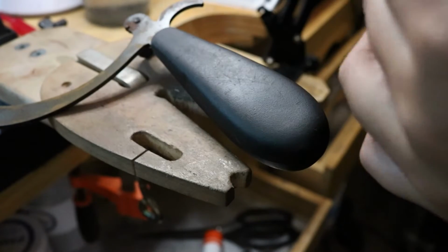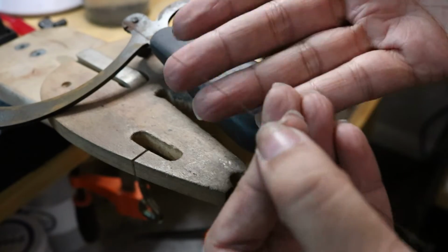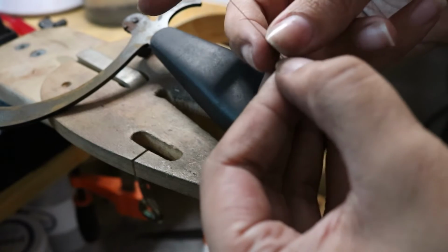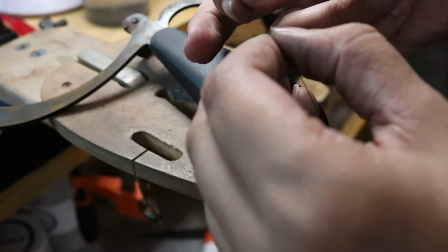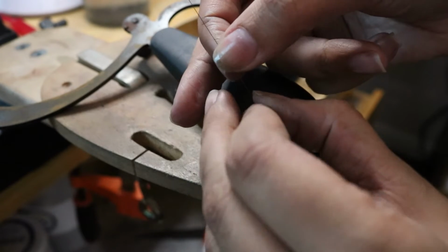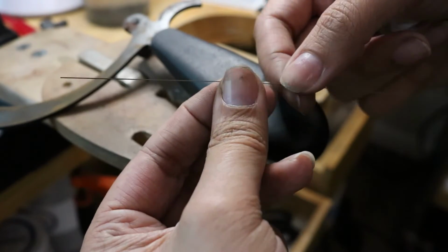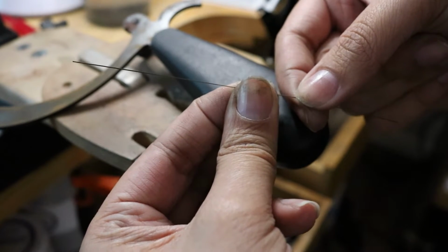It's very important that the teeth of the blade are pointing in the right direction so that you can actually cut efficiently. So you see how tiny these are. The first thing I look for is what direction the teeth are pointing. I do this by lightly pinching the blade and slightly moving my fingers up or down. If I move them down, I'm checking to see if my fingers catch. You'll see right here, my finger catches moving down. And so I flip the blade around and I pinch again. You see how smooth my fingers come down, but when I go up, it catches.